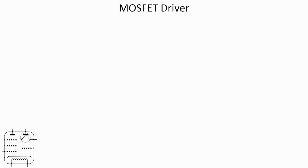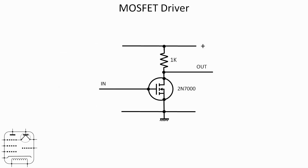I'm going to make a simple MOSFET driver using a 2N7000. I'll feed the signal in to the gate and take the signal from below a 1k resistor. The 1k resistor simply limits the current through the MOSFET - 1k with 5 volts gives about 5 milliamps of current, but it's the voltage I'm interested in. As well as looking at the action of the gate, we'll also check that our little MOSFET driver works correctly. Those are the two circuits we're going to use - so having talked about the theory, let's get on with it and go look at that on the bench.